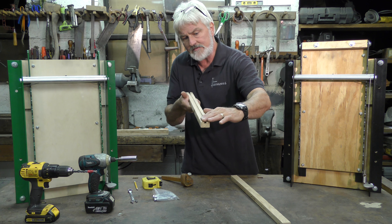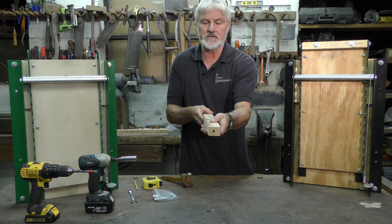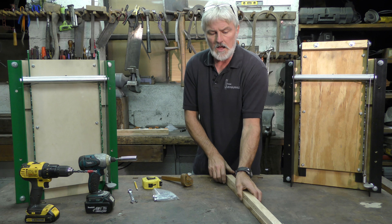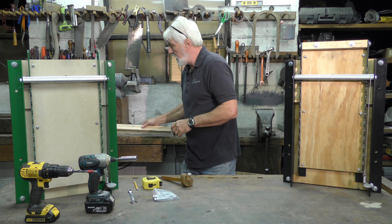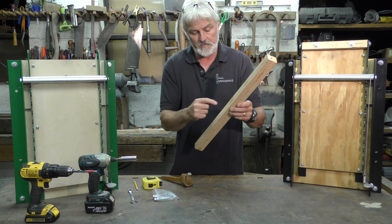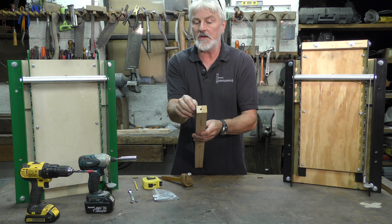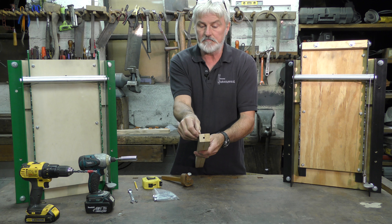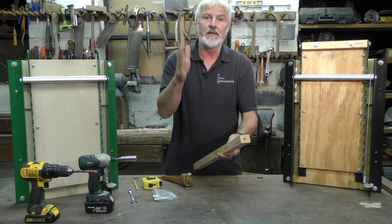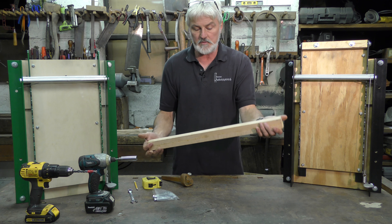Once you've done that, we're going to glue that dado face to one of the faces of the second piece. You don't need to watch me spread glue and apply clamps, so we'll pretend I did that and you end up with something that looks like this. I did not use metal fasteners to hold these together while the glue dried, because the last thing we're going to do is cut this down in thickness by about a quarter of an inch and we don't want metal fasteners in the way dulling our blade. So you're going to have to spread the glue, clamp, and wait.